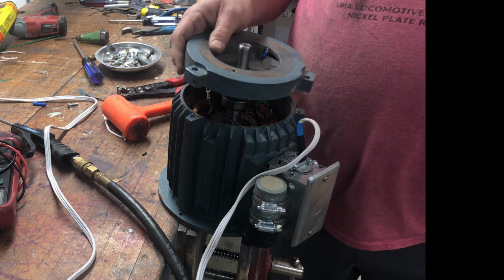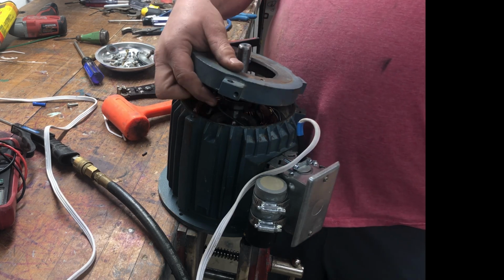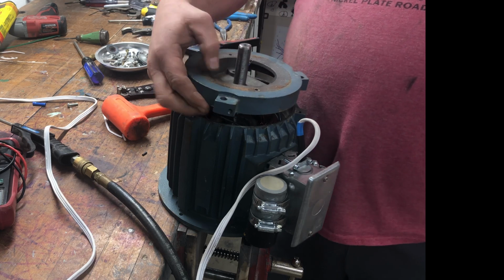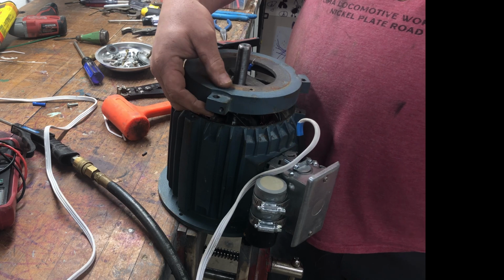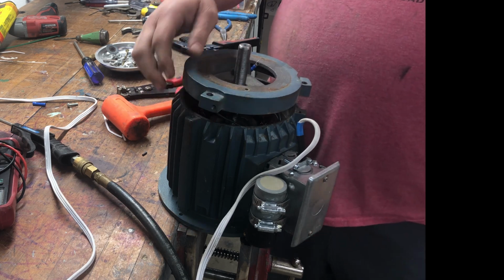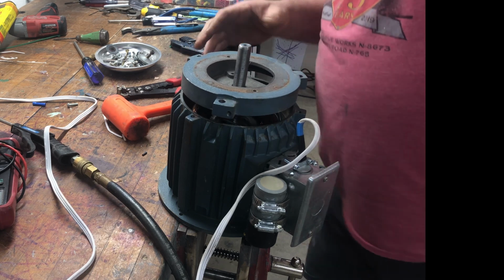During the course of this project, I found out that the rotor was hitting the inside of the stator a bit and had to sand it down with emery paper, as it was having a hard time getting spinning after I had disassembled it and put it back together. That's the nature of taking something apart and causing new problems.